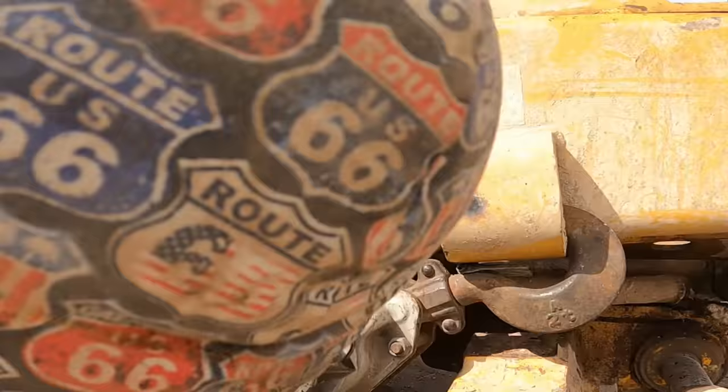Let me start gouging. All right, so my arc gouging here is gonna be very purposeful, in the sense that I'm probably gonna arc a little bit on and off, like you see me do it on some of my MIG welds at the shop. Just a little arc and arc and arc, just slowly take away what I need, because this material is very thin. It only looks to be maybe 5/16 thick, so I don't want to accidentally make a hole that I don't need to make. So I'll have to be very careful, just on, off, on, just keep doing it all the way down, unless I feel comfortable that it's gouging nice and smooth and delicately enough. But other than that, I'm gonna do it just in pulses to reduce the chance of busting through. I still might, so who knows. Here we go.